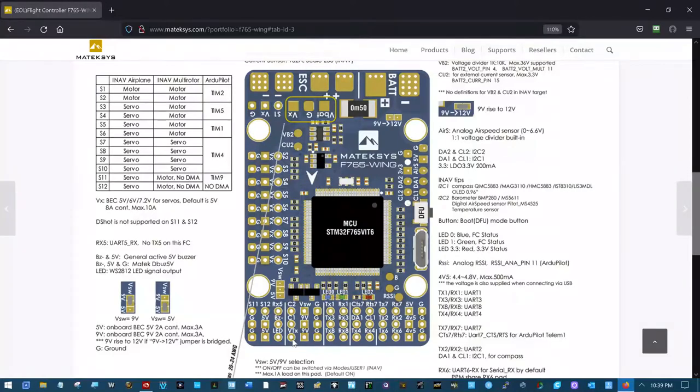Anyway, so there's your video into your video transmitter, or actually the video out of the board in truth into the video transmitter. These two cameras right here above bring the video into the board where the OSD is applied, and then that OSD applied video comes out this pin, goes to the video on the transmitter, red, which is what I said, so that's the yellow, red, 9 volts in.